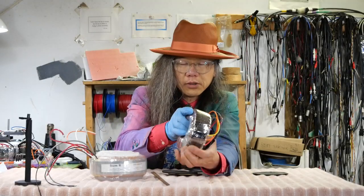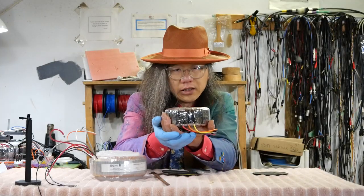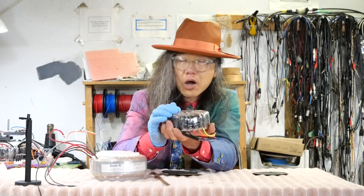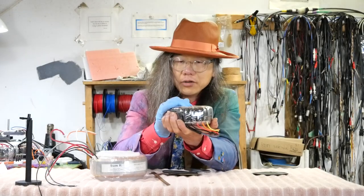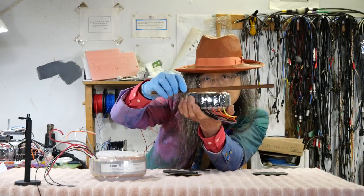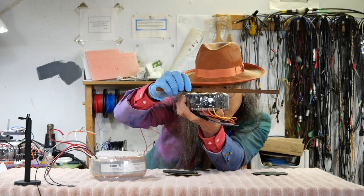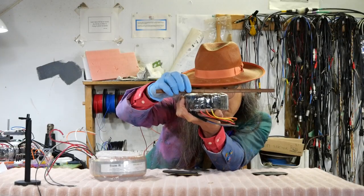Transformers sometimes have wires sticking out. It's not a bad design, it's just the way it is. Sometimes they use thicker wire, sometimes thinner wire. In this case they use thicker wire because it's a high-flux transformer — they have fewer turns and more space between them. You can see through the gaps. If I put a straight edge on it, you can see a lot of bumps and a lot of dips.